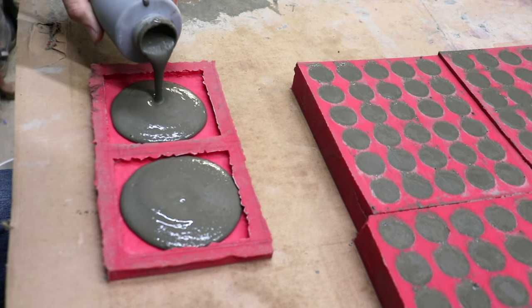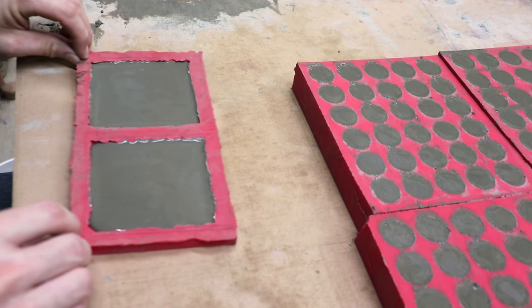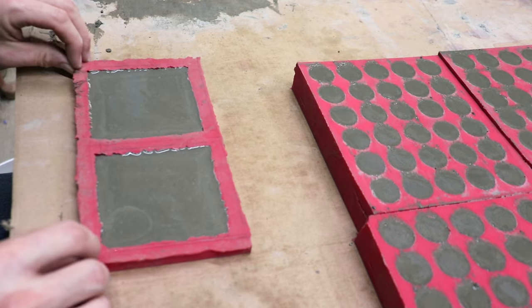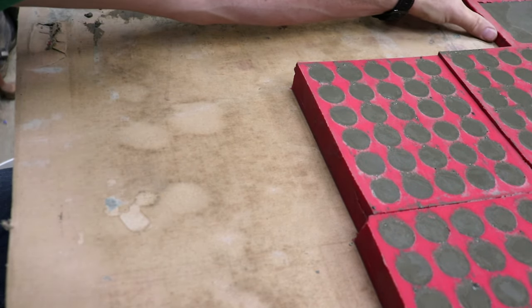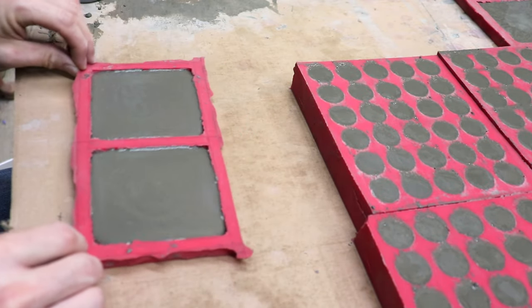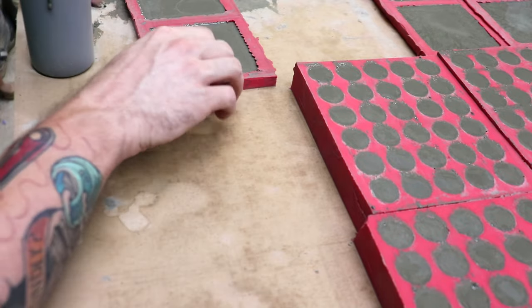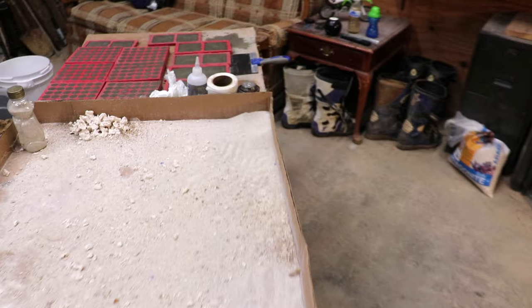And how you do that is you're going to freshwater cure them. There's nothing fancy. You can get a 5-gallon bucket or a tub in the backyard, and you're going to put all the plugs and the tiles, whatever you make, into that water. And this is a downside versus the ceramic plugs, because the ceramic plugs, when you fire them in the kiln, you don't have to cure them. They are ready to go right into an aquarium, and they're completely reef safe. Whereas, I really want to stress this point, you pop these out of the mold, you do not want to put them in your aquarium, because they will hurt things, the corals, the fish, it'll mess up the water quality. So you're going to put them into like a 5-gallon bucket, and you're going to cure them in fresh water. And I will show you how to do that.